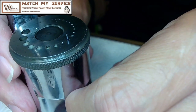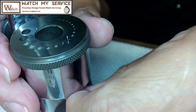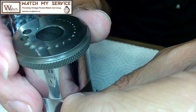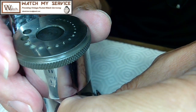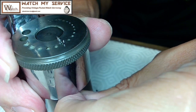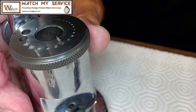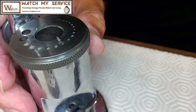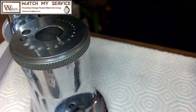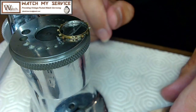I found a piece of metal I use for making balance staffs. There it is, poking through the hole. I move over one hole, find the other hole, poke it — and there we go! I'm a genius. I took a piece of metal, bent it, and poked it up through the bottom. The lesson: make sure the hole for punching out the balance staff isn't too big. There's the balance staff and the balance.